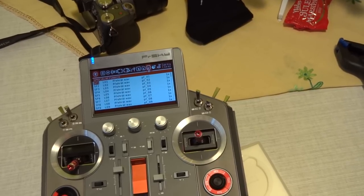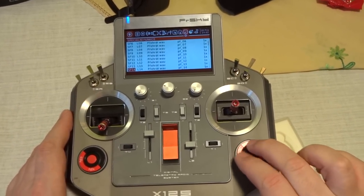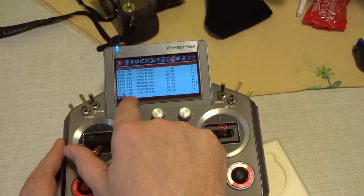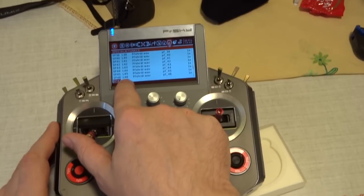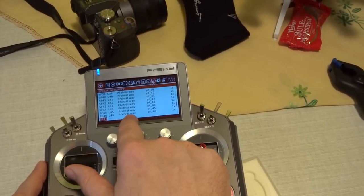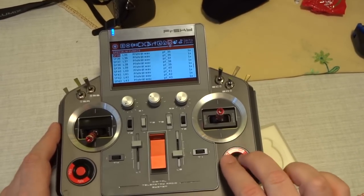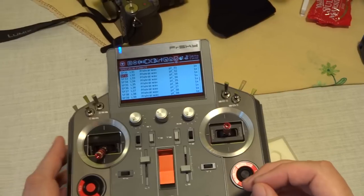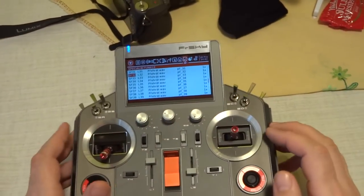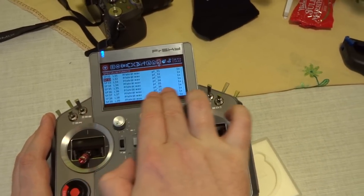And on next screen, in special functions, I have 46 tones, so I have 46 special functions. Each special function is with condition of logical switch with the same number, and it will play sound or play wave file from memory card with the same number. So I prepared all of this with the same number. Why? Because with the same numbers it is controllable. Combinations of different numbers could be completely confusing. So in special functions, you must have the same numbers.